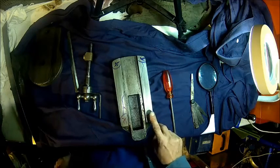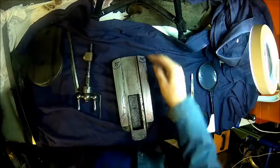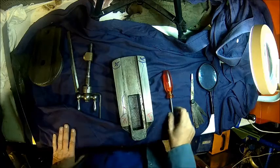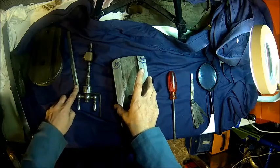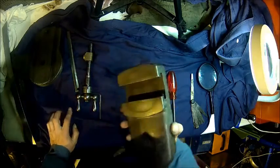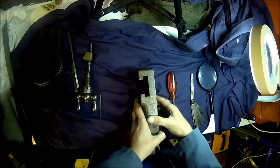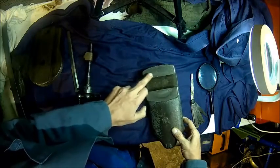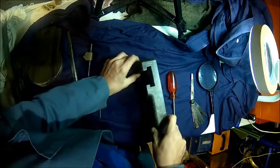That explains why the gib was loose, because apparently if you move it in, it's binding. I couldn't feel it. It was a bit harder to turn, but it was still okay. But once I tightened the gib a little bit, it was okay. I could actually machine something. But the other problem is this one here, and that's the major one. This is the tool rest. It's got some dings and dents and some battle marks as well.